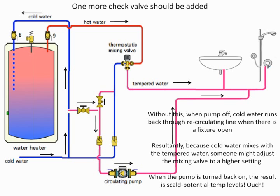One is in relationship to applying thermostatic mixing valves or circulating pumps: are there any implications as it relates to Legionella bacteria prevention? Yeah, absolutely. Legionella pneumophila, the bacteria that causes Legionnaire's disease, can grow at an accelerated rate in temperature ranges, I don't have it in front of me, but around 85 to 110 degrees. It starts to go dormant after that. By 131 degrees after a five-hour period, you kill the bacteria. At 140, you kill it almost instantly.